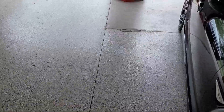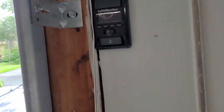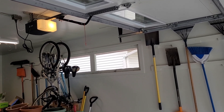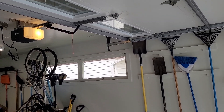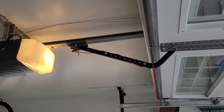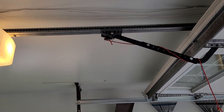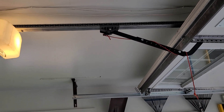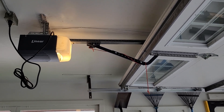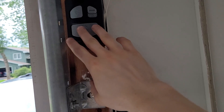We'll give you a sensor and force test on each opener. I discovered something kind of interesting on the LD-050: the Linears do stop going down, and if you stop this LD-050 going down, it actually runs up just a tiny bit. I feel like that's probably just to try to keep it from drifting or something. You might be able to see it bump up just a tiny little bit. Anyway, I'll give you a sensor and force test on both openers, starting with the LD-050.